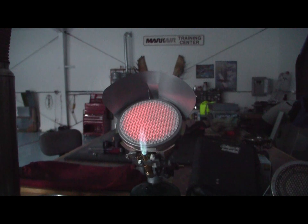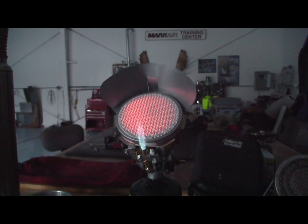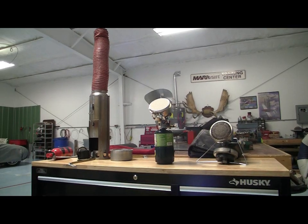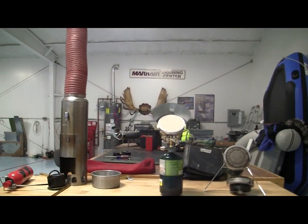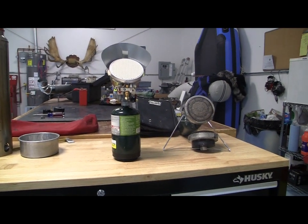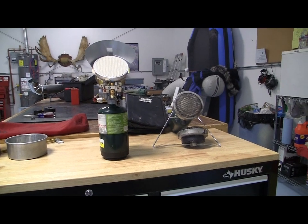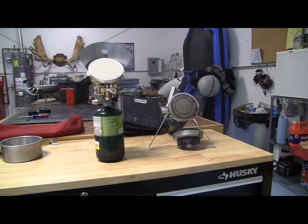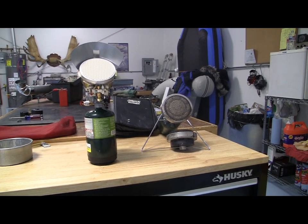I've never used this as a preheat source. I kind of played with it. It is an option, and it generates a lot of heat. So the propane options are really meant to keep the engine warm, because propane, if you put either of these into a cold soaked engine, after about 20-30 minutes, the regulator will freeze and you'll lose your heat source. So I only recommend using these propane ones in an engine that is warm so that you can help maintain some heat level in the engine.